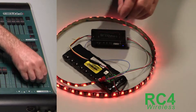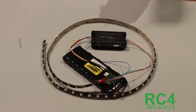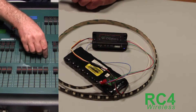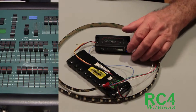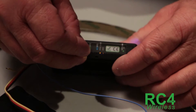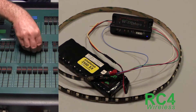The color order is different because the LEDs appear to be in the wrong order — let's not worry about that for now. Let's set the whole thing to work on channel 13. ISL — inverse square law slow curve — is the best dimming curve for LEDs. I've brought channel 13 up to 30 percent to select ISL, then push the set button, and now we see the reds come on. We'll have three contiguous channels: red, blue, and green, since they're out of order.